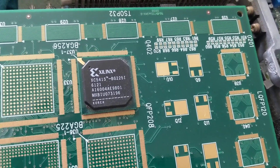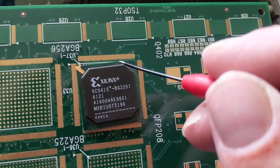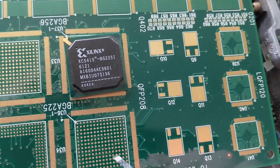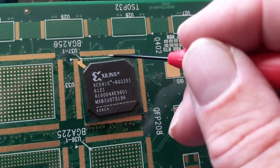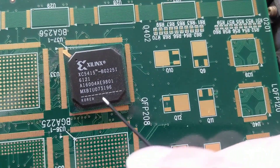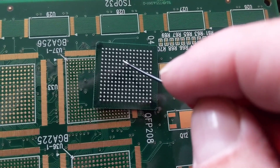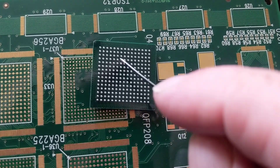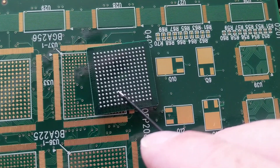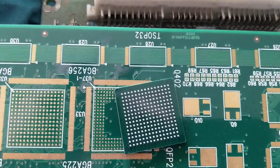Or in a plane — you took off and then landed. The electronics took a lot of force. What happens to this BGA? It shifts — even less than 5 or 10 degrees. That little shift messes up where the balls make contact with the solder. Now it's crooked from vibration; it moved from its original position. The ball grids are not making proper contact. Even if one is off, your voltage could be wrong, your B-plus supply could be off, or you could be shorting two pins.